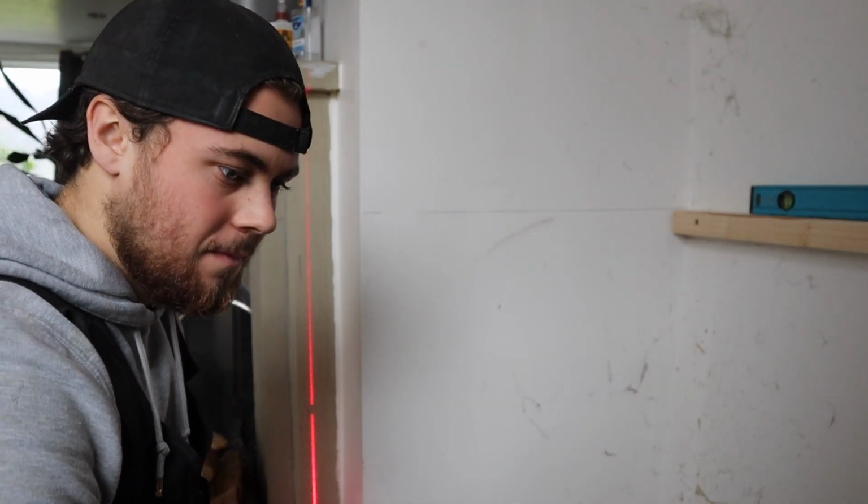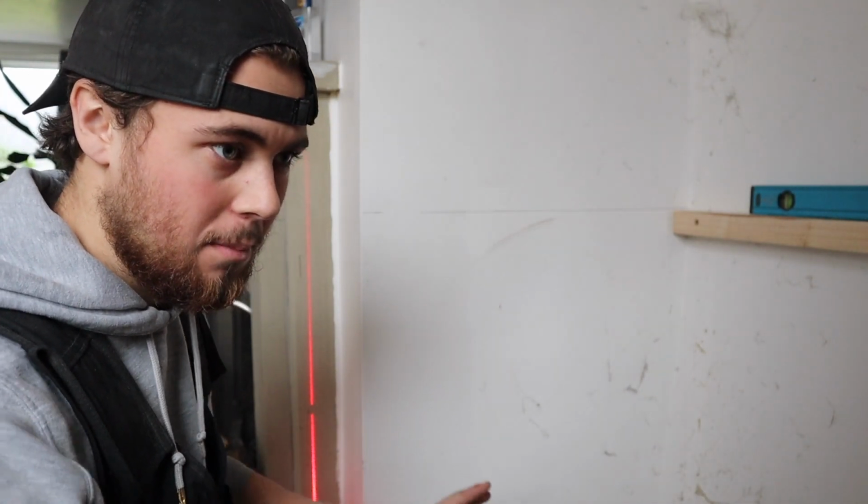I'm excited about this one. It's a new style I've adopted doing this. It's actually building a frame and then putting them in. Usually what I used to do is build the carcass and then put it in. I prefer building a frame. I just find it easier for some reason. I tried it on a job before and it turned out pretty nice, but I wasn't happy with the job when I finished it. And plus there is a bit of weight going up above it, so having the frame gives it a little bit more oomph, a bit more strength.